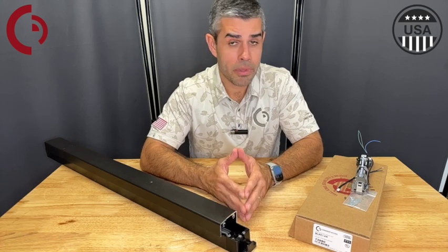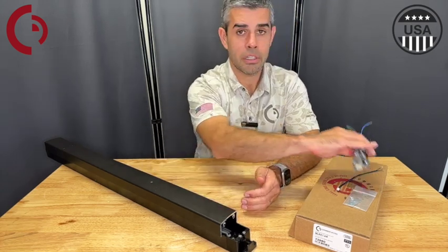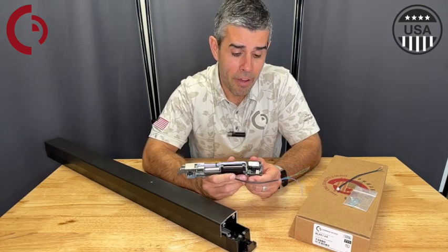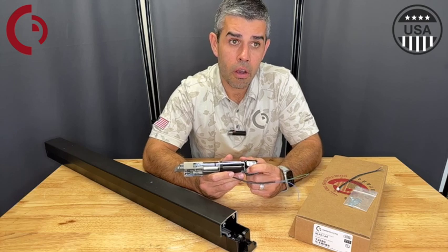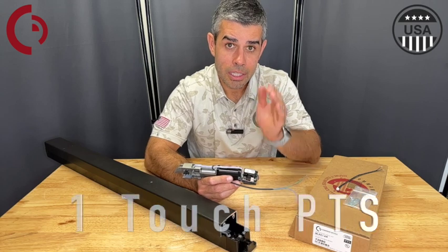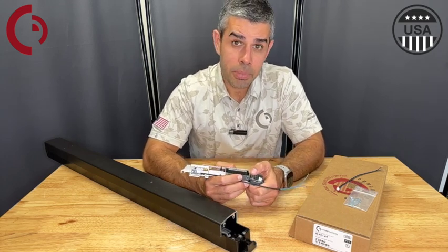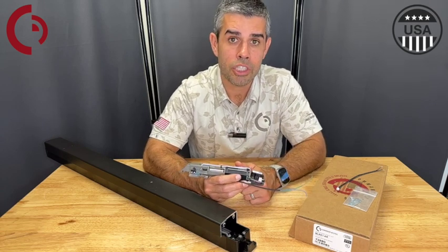Let's jump into some of the changes on this new Adams Rite kit. First off, we're going to see a new module — it's been upgraded to our MM5 module, so we have our new Molex connector for power and then our one-touch PTS. There are no more torque settings; standard is going to be max torque. The one-touch PTS simplifies the post-installation process for adjustments.